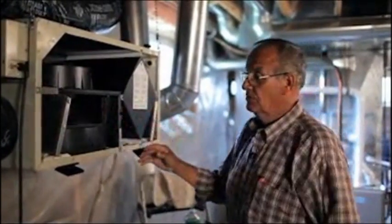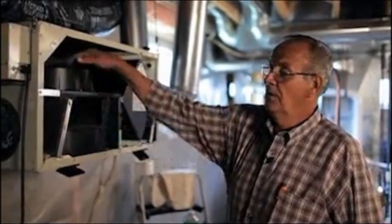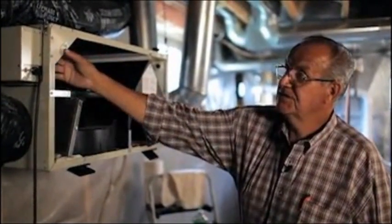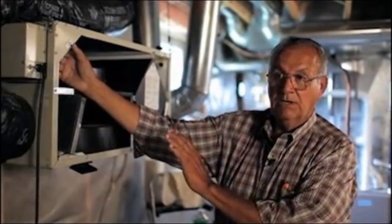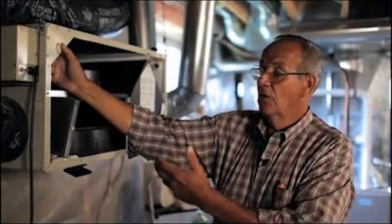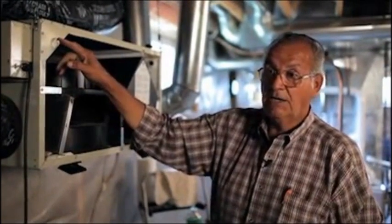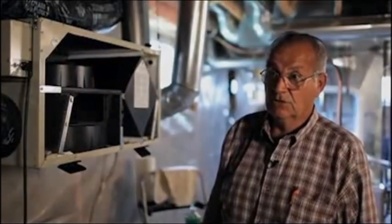Now here's the unit. The fans I talked about, there's one right there, and there's one up here. Those are the fan blades that I talked about. This is the safety switch. So when the door's off, this machine won't run. Like I said before, if the machine hasn't been cleaned very often, this will stick. So you take the door off and the machine's still running. This is how we can test it later on, to see to it that everything is going to work.